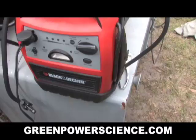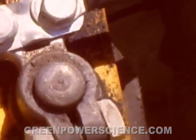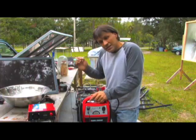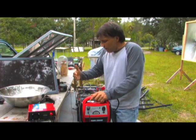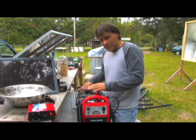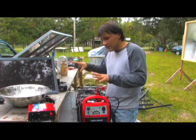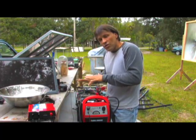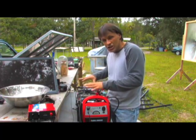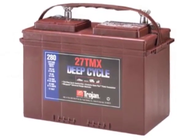For your house, you'd want to get battery leads from an auto supply store — they make them for semi trucks and that sort of thing. What they do is basically the same thing you'd hook to your car, but they allow you to hook batteries in parallel. By hooking these batteries in parallel, our voltage stays at 12 volt — it doesn't change the voltage. What it does is allow all the batteries to draw down equally, so this acts as a giant battery bank.